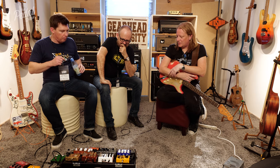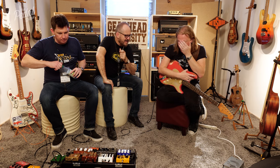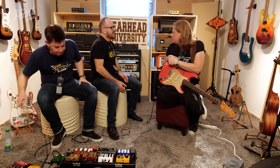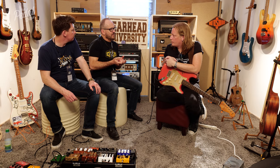Part of it is the 2 amps thing, isn't it, as well, you know? Like, for years... Yeah, but I'm pretty sure that there's a mod that you could do. Right. You know, so if that's running at line level... There's probably a couple of big resistors on the input that you could change to make it receive a smaller signal.